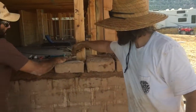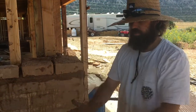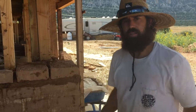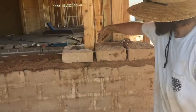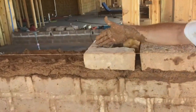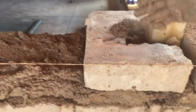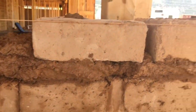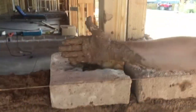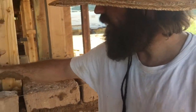When you're cutting that much out of these bricks, they get real fragile in the corner. So make relief cuts so that you can take out that material without breaking the brick. You could cut a little piece of brick and wire tie it to the post, just like brick masons do — it works. But if you can keep it attached, it's a lot easier, because those separate pieces like to slump out a little bit.